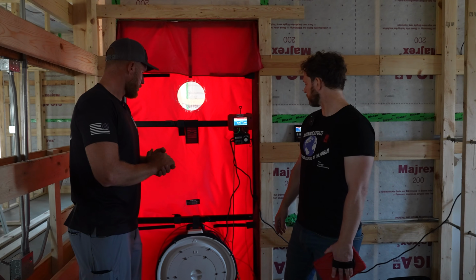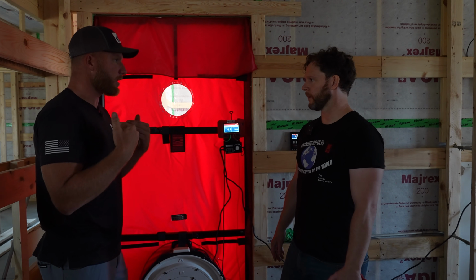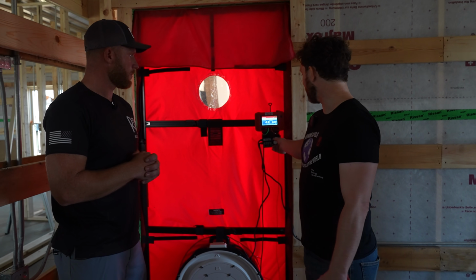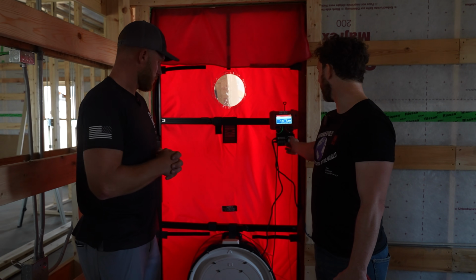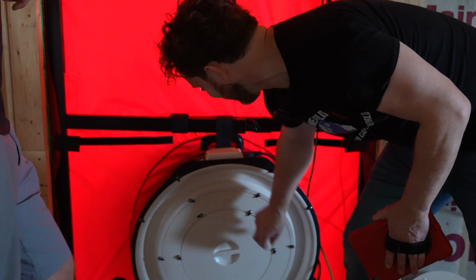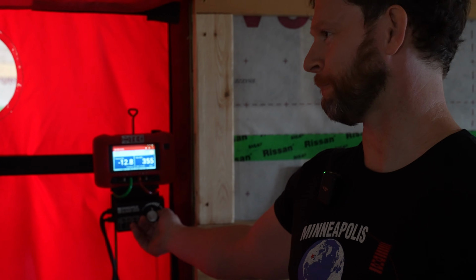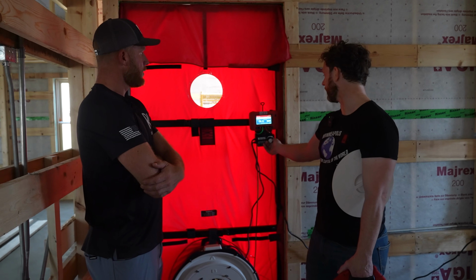Okay. All right, so first test we're going to do is just a simple turn it on, and you're going to try to get to 50 pascals between the two? Well, I can show you just quickly how tight this is when we start to turn this on. I can go nice and slow, and if you watch this channel here, go up to 50, just to show how tight this building is. I'd normally grab this and just turn it up a little bit. Are you saying it's because you're forcing a ton of air right away and it doesn't have a lot of places to pull from? Yeah, it pressurizes very, very quickly.